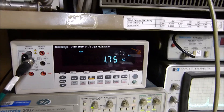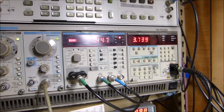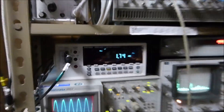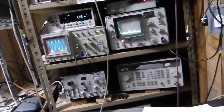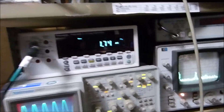Right now we're running 1.75 watts. Let me work on that glare just a bit. There we go — half-percent distortion at one and three-quarter watts. I have no negative feedback in right now — no negative feedback at all.